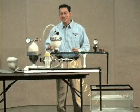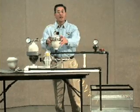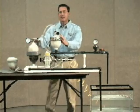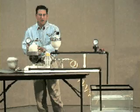This first test stand is comprised of a half-inch air-operated double diaphragm pump fitted with a Blacoh pulsation dampener on the discharge with the adjustable air control. On the inlet side is Blacoh's inlet stabilizer fitted with the J air control.